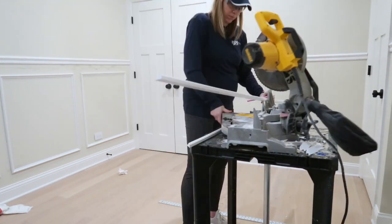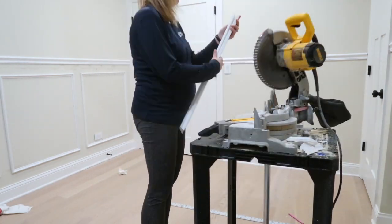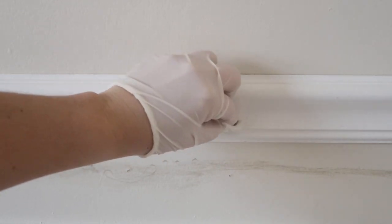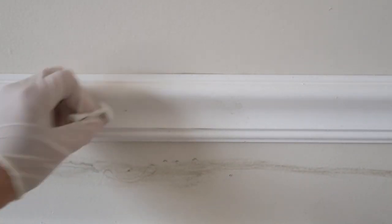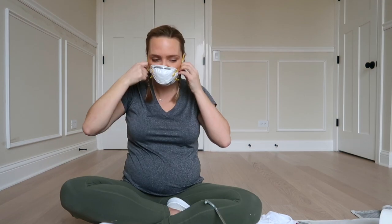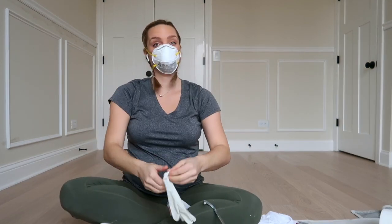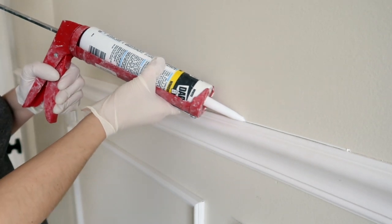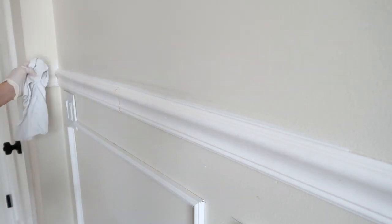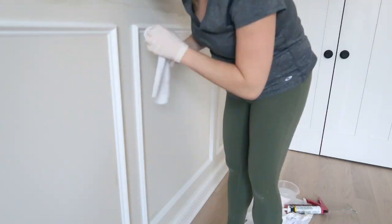It took me one day to get the chair rail and picture frame molding up on three walls in the nursery. It's day two of the chair rail project and all of the wood is up — it looks amazing. Now it's time to do some prep work in order to be ready to prime and paint. I first fill in the nail holes using painter's putty — just ball it up and smush it into the holes. Caulking is a bit more time consuming. I'm using white latex caulk with a caulk gun, wearing a respirator and gloves as an extra precaution since I'm pregnant. I like to run a thin bead of caulk along the line, follow it with a wet finger, and wipe up any excess with a damp rag. I do this to every single seam on my wood pieces.